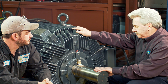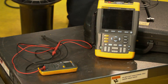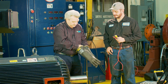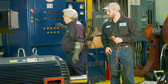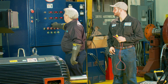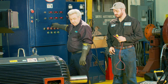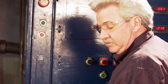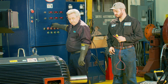Okay Brett, now you understand pretty much what we're going to do. Let's go ahead and run it. We're going to go ahead and put on the high voltage gloves and get ready to start this. We're going to start it at 55 volts. We'll kick it up here in just a few seconds and take it up to 125 now.